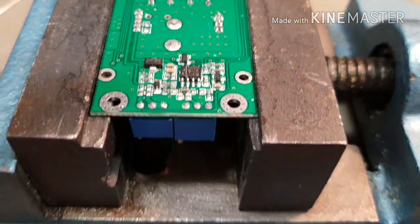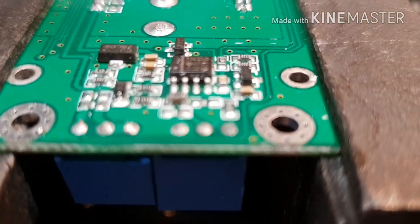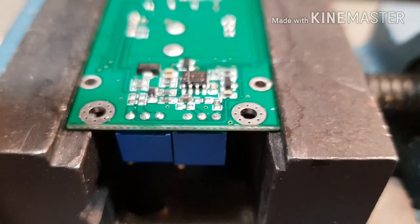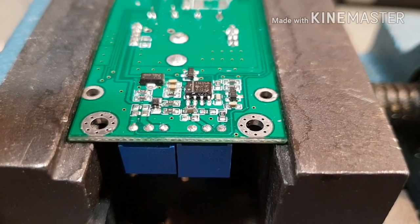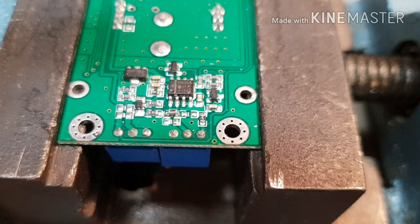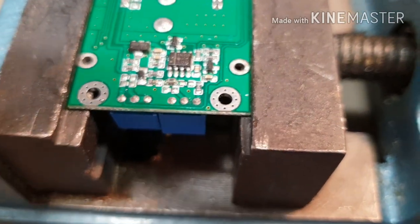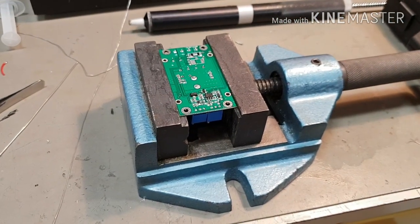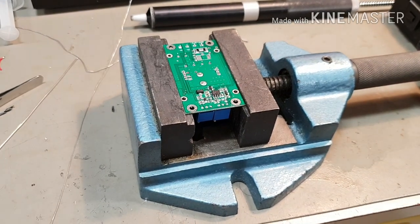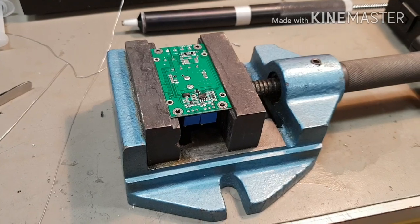Okay, so it's soldered on there. I don't know if you'll be able to see that. So we can get that to focus. There we go. So I'll just piggyback the resistor right on top of the capacitor. I still want the capacitance there because it dampens the AC response of the circuit, which I don't particularly want to be too high. Too reactive to high frequency changes, or it's going to be prone to oscillate in step load conditions.